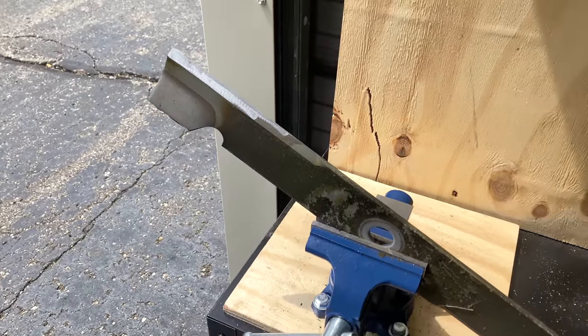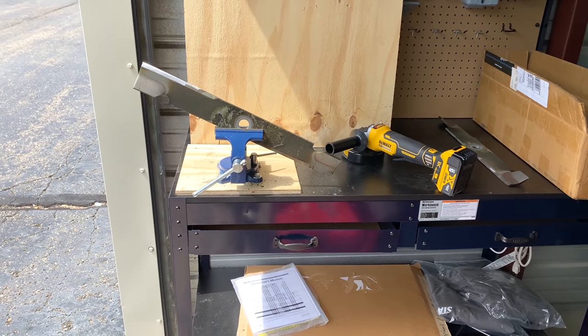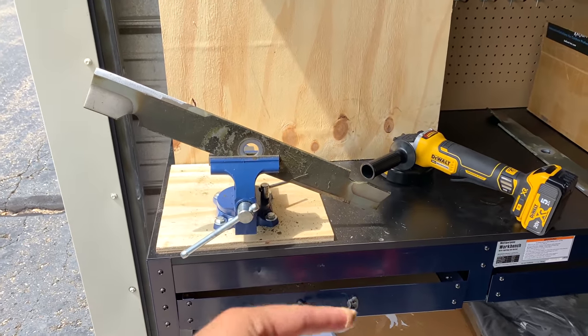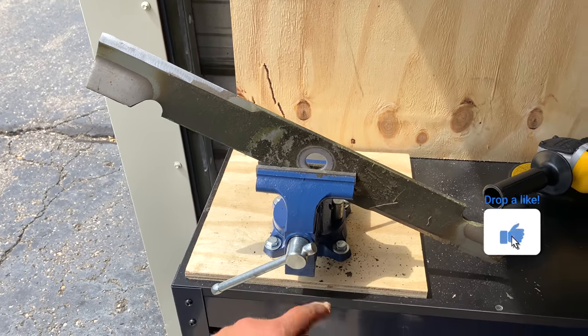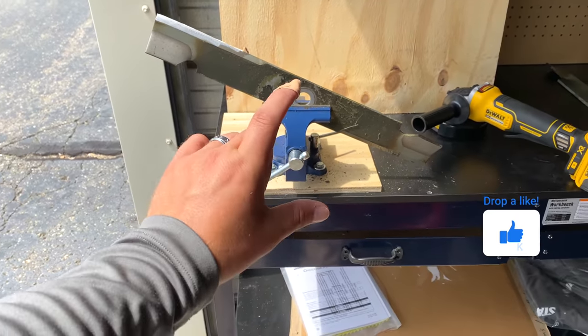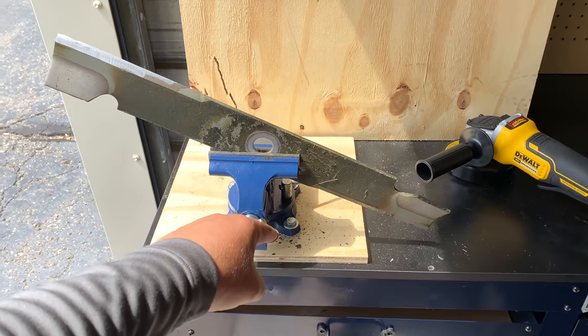So that's what I got for you guys on the little DIY workbench, little $200, $250 value here. Hope this helped you guys out. By the way, underneath those bolts, they worked out great. We were able to tighten those up, so everything worked out just well. 3-inch 3/8, all right? So 3-inch bolt, 3 inches long, washers on both sides, you're good to go.